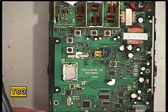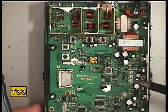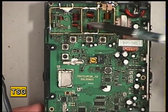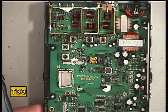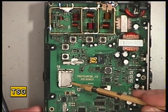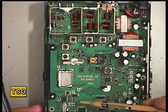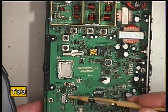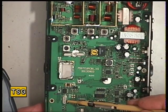Looking at the way the circuit is — and I haven't got a circuit diagram so there's a lot of guessing here — the transmitter line-up is not adjustable and all the inductors are preset, which is good in a way. I wouldn't be able to tell you how we set the VCO up but the VCO is clearly there, and there are test points here and there. The master oscillator at 10.24 MHz is down there but it's not adjustable for frequency, so let's hope it's on frequency.